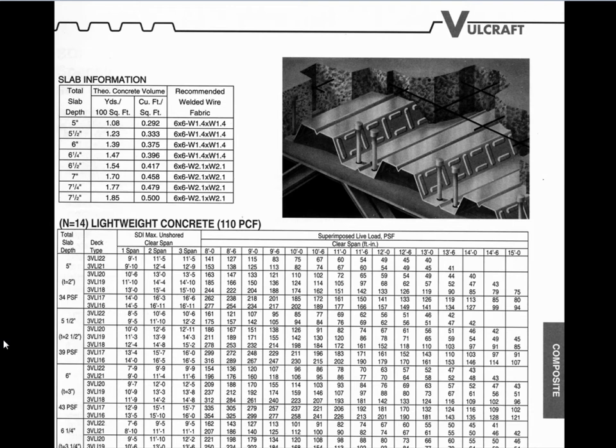In addition to smooth roof decking, we can also do corrugated floor decking. In this case, the concrete gets poured on top of the decking. There's always some kind of wire reinforcing, which may be supplemented by rebar in critical situations. Notice the curious embossing pattern on the floor decking that you don't see on roof decking. The embossing assures a shear connection at the interface with the concrete — when the concrete is poured it oozes between the embossing, assuring it can't slide. Once the concrete is cured, the deck works with the concrete in compression and the corrugated decking in tension.